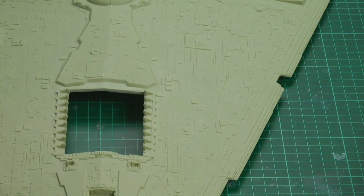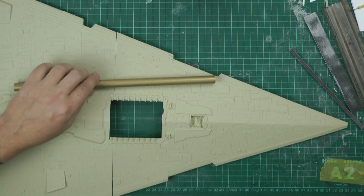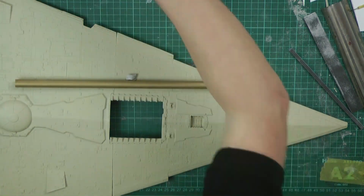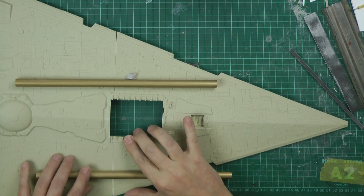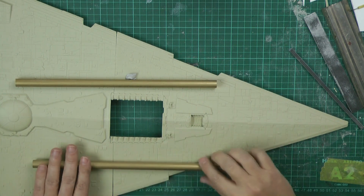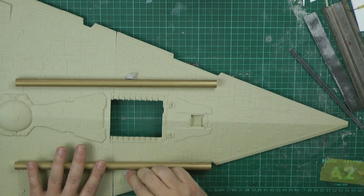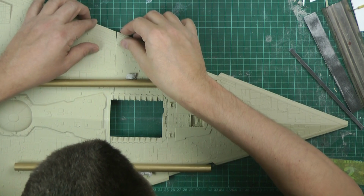Okay, so again, iron bars, well, these bars actually work really, really well. If we just stick one on here and then a little bit of tack just stops it rolling off, and the same on the other side. What this is doing, it's holding everything square because it's continuing the line. So if this is raising up or pushing down, by putting these bars on, they give us just that right amount we need on there. So now whilst they're sat there, we can just manipulate these around.